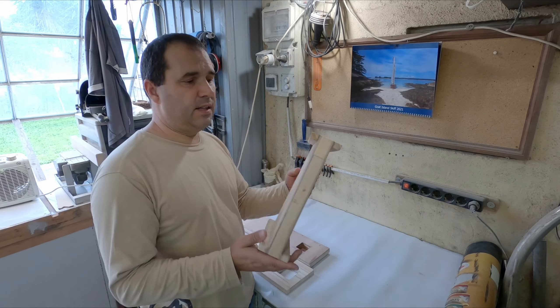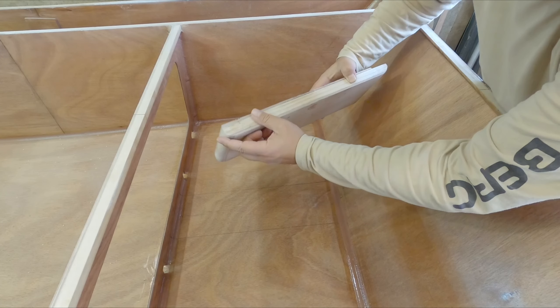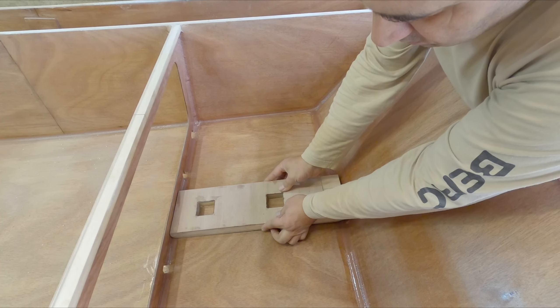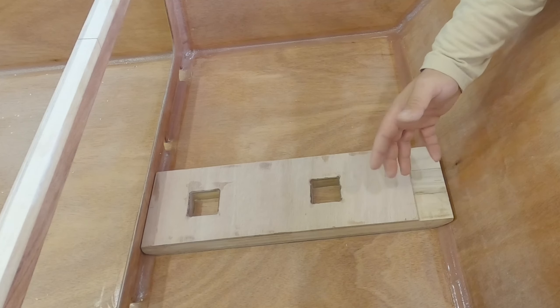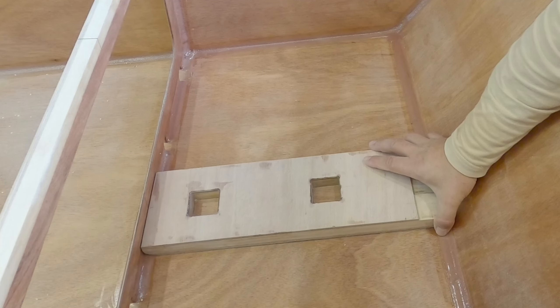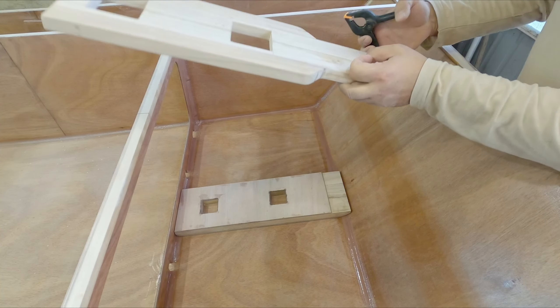All right guys, the parts are almost ready to be fit in place on the mast step. I've had to round this to match the fillets between the bulkhead and the bottom. If you've done the timber frame method this should be just a straight cut but at an angle as well. I've cut the notch already on the center case — it's better if you cut this slightly bigger than slightly smaller, because you want to make sure that when you put the mid seat it will sit against this perfectly. It's better to have one or two millimeters more on this cutout than to have it smaller.